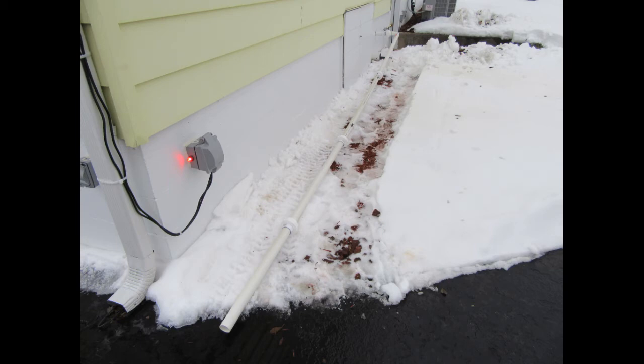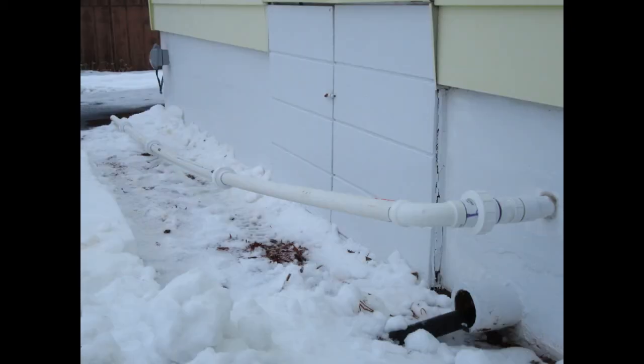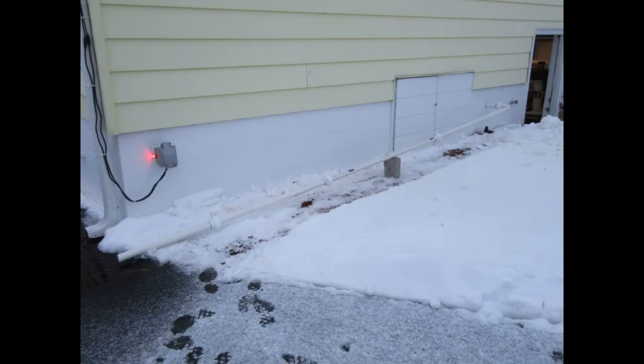I like this approach, although the cost of the unions is certainly a little extravagant. I probably could have just stuck the pieces of pipe together with simple sleeves, but I worried about keeping them together and didn't want to put screws into them, so I paid the extra cost for the unions. The pipe of course sags under its 16-plus-foot length, and while it might be okay, I wanted to support it. Temporarily I just stuck a cinder block under the middle of it to prop it up, but then I got to work on making a more permanent support system.